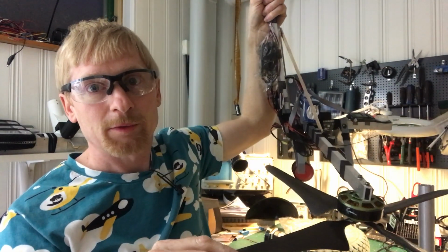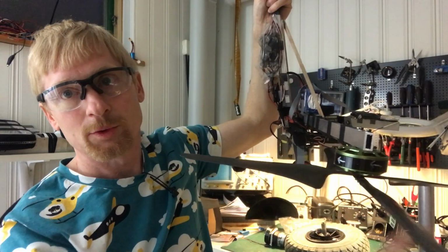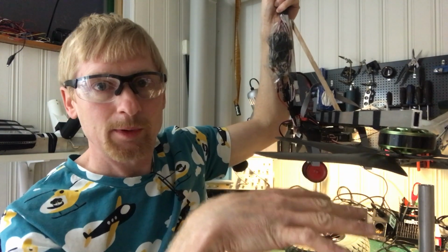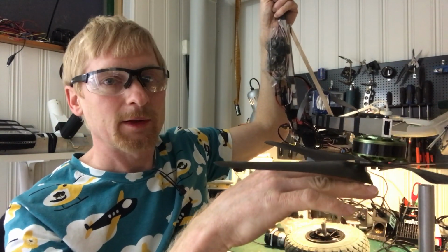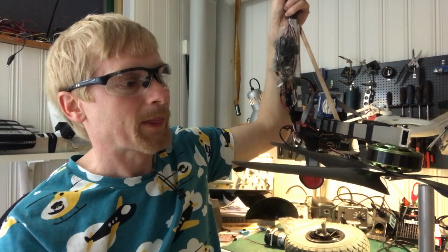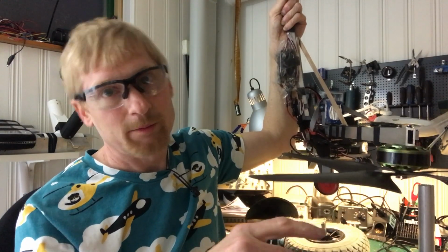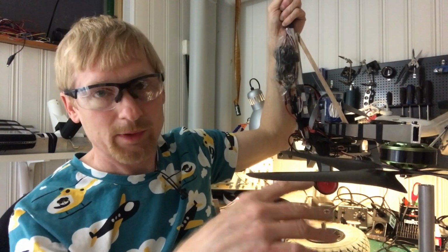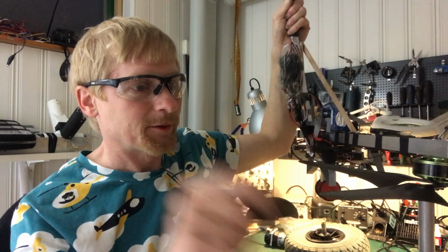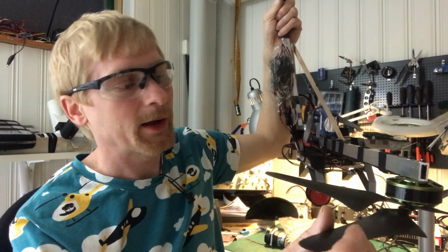The good thing with this structure is that it's going to be super light, and the propellers are just slightly over 2 meters in diameter. So it sweeps a pretty large area, which means that the velocity does not have to be jet-ish high, it's lower. But still, it's an obvious risk that the loose soil and dirt will get picked up in the turbulence here, and start circulating through the propeller blades, and they will erode quickly if that happens.